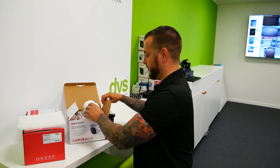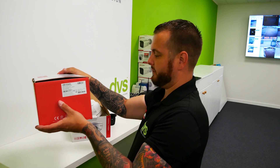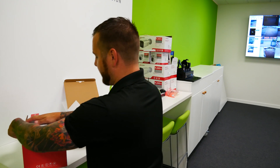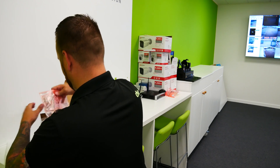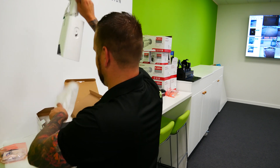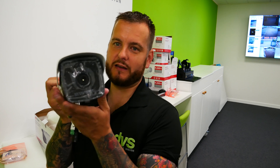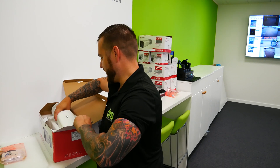It never replaces fire detection — it aids it. We'll power that up and have a quick look at the smoke detection; I haven't smoked for many years but I do still have a lighter to check that. Then we've got a dedicated thermal-only bullet camera. It comes with all the accessories in the box, even a back box — really handy. Inside there's BNC, audio in and out, alarms, PoE, and a new adjustable bracket like the newer 2.6 series style. This is thermal only — not a bi-spectrum — but for some applications you only need thermal.